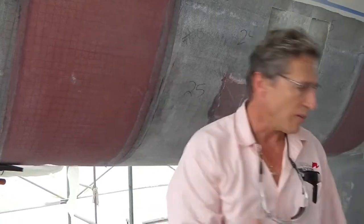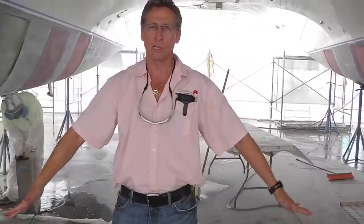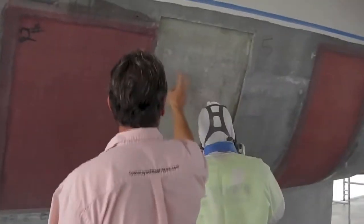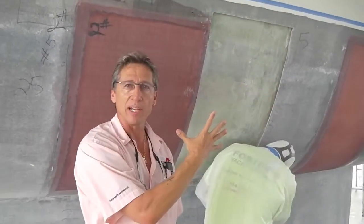the exterior skin. If you follow me over here, you see right here, these are straps that strap the boat to keep it together just in case it decides to buckle. If you look here, they're cutting out. Here's your inner skin right here. You can see how light that is. So we'll put a couple bonding layers here, vacuum bag in core, and then have our final laminations on there.